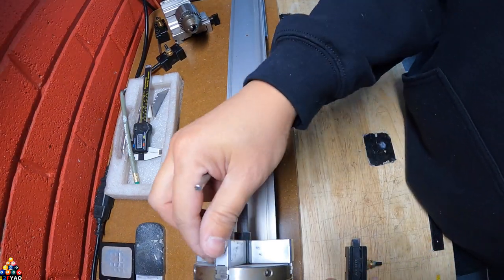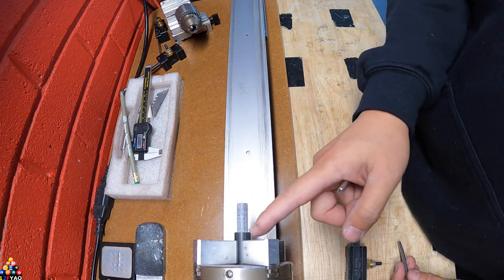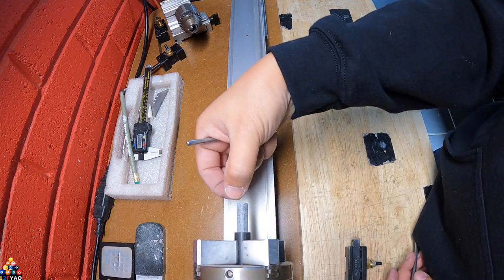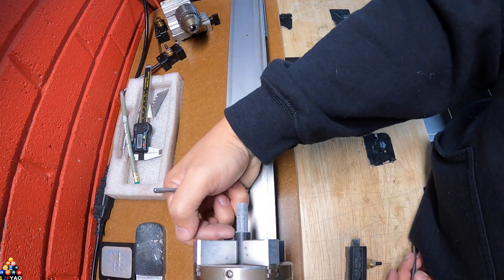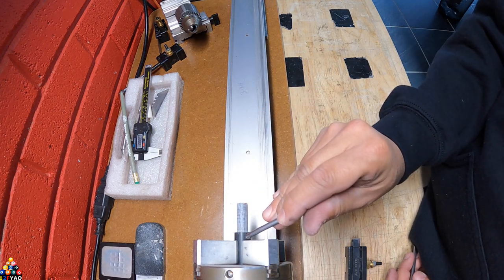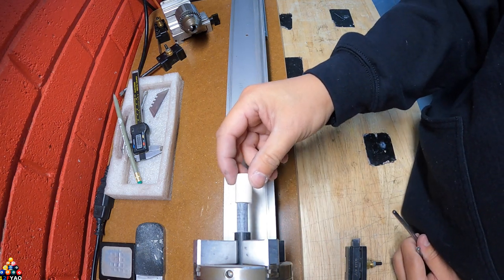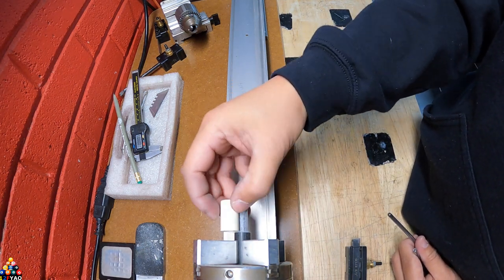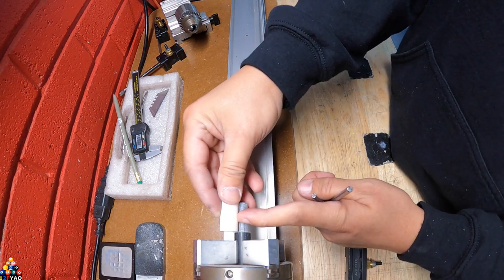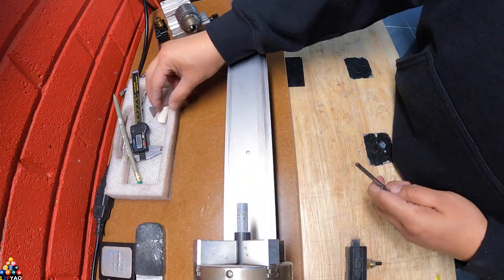Now that we got the G10 to size and it fits perfect, all I'm gonna do is get this as the plate. This will be the tenon, cutting the G10 about here and helping it plate. Then I will be boring this so it fits inside the tenon, getting this to size and measuring it exactly to where the previous shaft was.